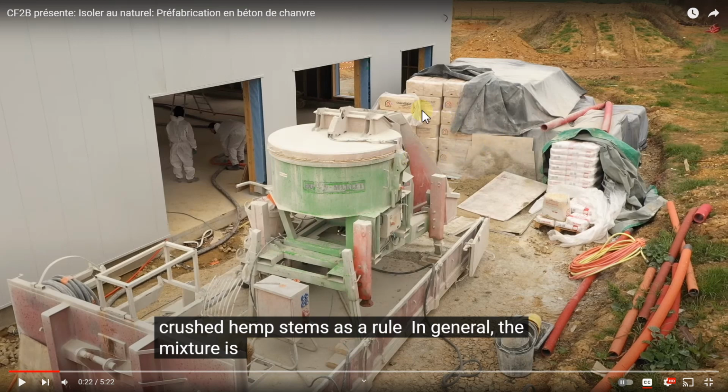We're looking at Chanvre-Bat and Tradical PF70, which is a preformulated lime that has hydraulic lime, hydrated lime, and a pozzolan. Now that is an interesting mix because we're looking at an alkali activated material, and the pozzolan is the precursor that has a concentration of alumina and silica, which reacts in a high alkaline environment. This is similar to what occurs in geopolymer, but not quite. It's simply known as alkali activated materials or alkali activated cement in the current nomenclature, if you will.